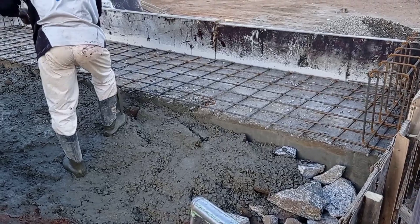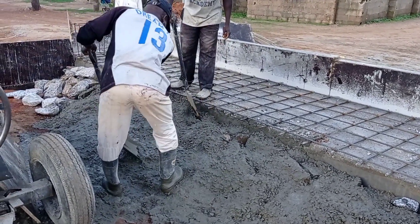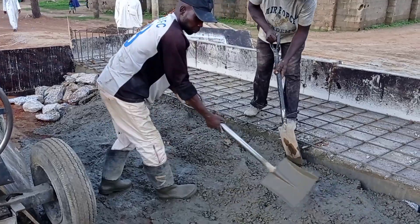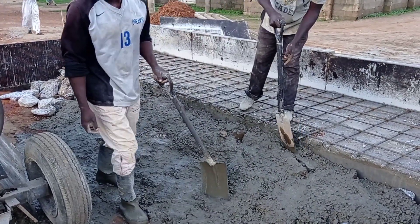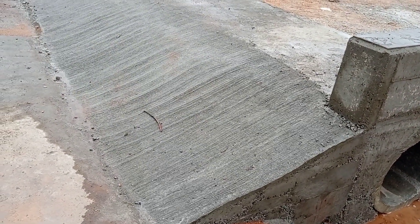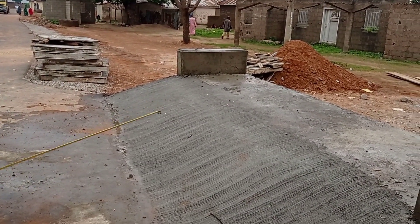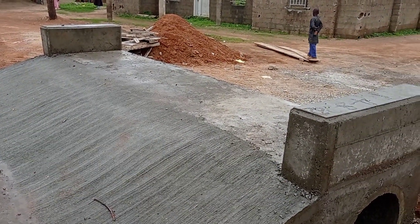After pouring concrete, we used a concrete vibrator — as always, it is used to avoid honeycombing. You can see that we are pouring concrete all around. The height of this decking is maintained at a level which is above the asphalt, since this culvert is around the roundabout. Thank you so much for watching this video — until my next video, goodbye.